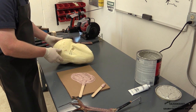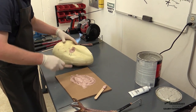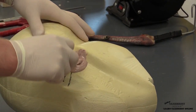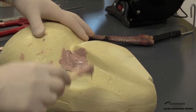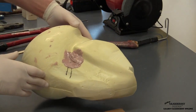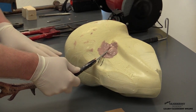Now that our auto body filler is mixed up, we'll fill the hole we drilled into the form. Because we put a quarter-inch hole in the back, no vacuum is created — it allows us to push the Bondo into place. We want to completely fill this cavity. The Bondo is also getting into the splines and grooves we made, which will help prevent it from turning or moving when we're positioning the legs. Make sure the spur is in on the correct side of the form.